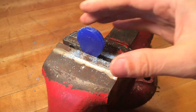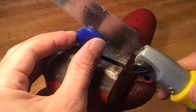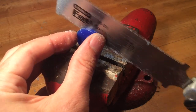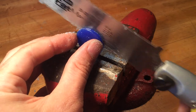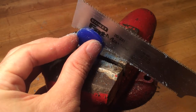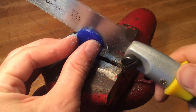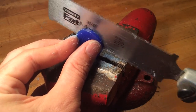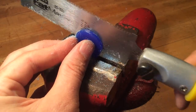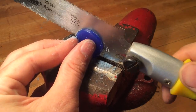You can see it's rotating again and you need to tighten just a little further. What you don't want to do is clamp on to your final wax — the flame-polished, well-carved detail — because the compression of the vise will distort the wax, make it prone to fracturing, and mar the surface. It'll gouge itself into the surface of the wax it's holding onto, which is why I always keep a little handle on my wax until I'm sure I'm close to the final process.